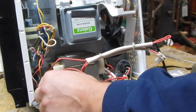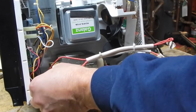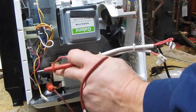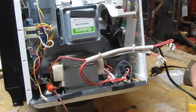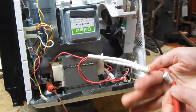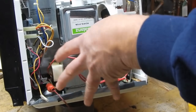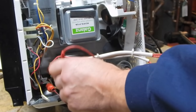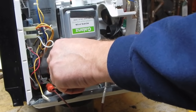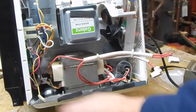While I've got this plug off the primary, I'm going to do a quick check - go from one lead on either one of the primary connections over to the secondary high voltage tap, and I'm looking for infinite resistance there, which I have. Then also on these connections going up to the magnetron - if you have any reading at all between those two then you've got a short of some type between the primary and secondary winding, which is even rarer. Also check to the case of the transformer - any reading at all and you've got a short from the primary winding to ground. Primary winding is checking out perfectly fine.